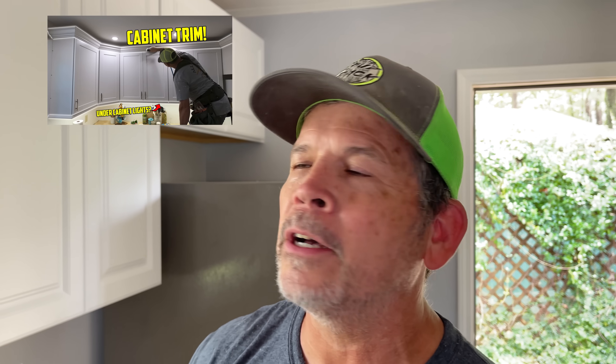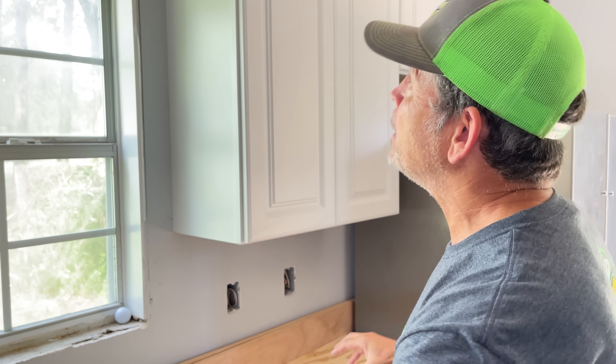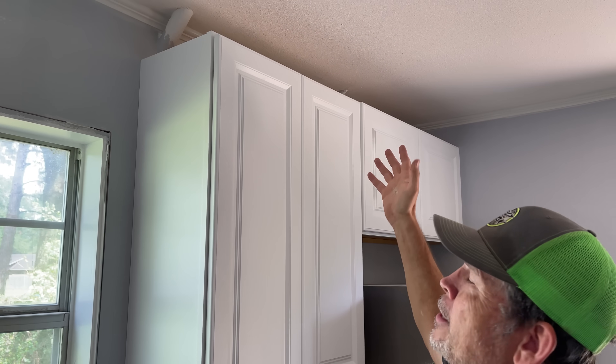Hey gang, it's Paul from StudTech. Welcome back to our channel. In some of our previous videos, you've seen Jordan and I install a lot of crown molding on a lot of kitchen cabinets. The method we use is pretty popular. You simply put a notch in the face frame, take your pre-assembled crown molding, set it into place, a few nails, and you're done. It makes for a perfect seamless installation.